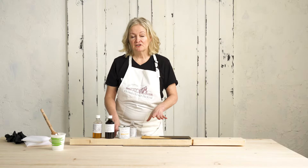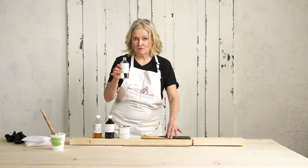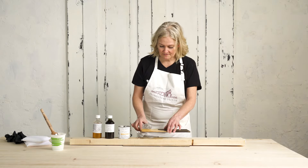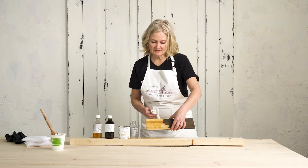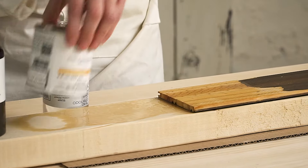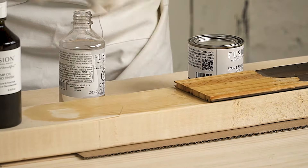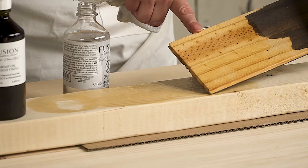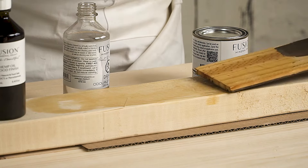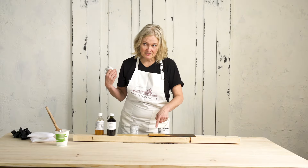To see what your wood project will look like with any of these unpigmented oils applied, simply add some odorless mineral spirits right onto the wood surface and it's going to darken — it evaporates pretty quickly, but it gives you a snapshot of what your wood will look like with these oils applied. Notice how this new pine looks almost white while the other has more of an orange hue because of the age — this pine has already had a chance to age and oxidize. The older the wood, the darker it looks.